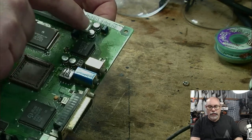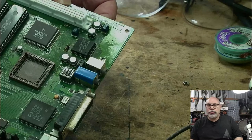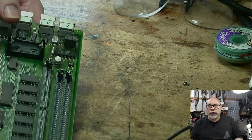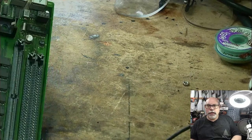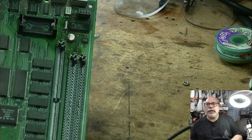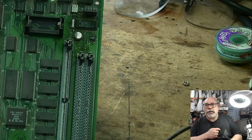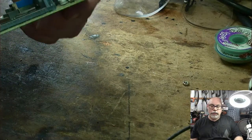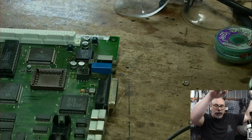So all of that stuff, this whole region around there, that should all be shiny, but it's completely, totally matte. And you can see it here as well. Again, just trying to get that light catching on it at the right angle. Having trouble. There we go. You can see it there. You can see there's that dark, smeary blob going all the way around there, and that's your capacitor leakage there. And so, you can just glance at this board and go, oh yeah, it doesn't look too bad, but then you just catch it from the right angle when the light's bouncing off it, you can see, yeah, that's a lot of scunge there.